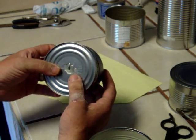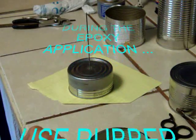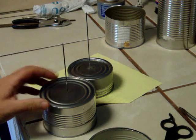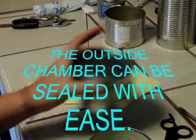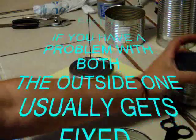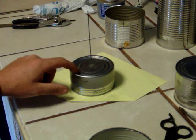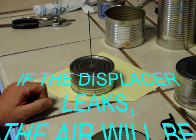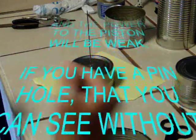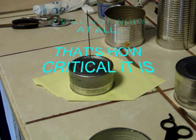The next thing we really need to do is make sure it doesn't leak — we don't want air to leave or come in. 90% of all home-built Stirling engines that do not work is due to a leaky displacer and leaks in the outer chamber, or too wide of a hole that makes it leak even more. The outer chamber leaking is about 15 to 20% of the problem, but this — the displacer — is 90% of it. If this leaks, all that air inside acts like a sponge. If you're trying to hit something with a hammer and there's foam rubber in the way, nothing's going to happen — it will absorb and cushion. Air compresses; you can put a vacuum on it and it's springy, just like your bicycle pump when you push it down and it pushes your handle back up. That's because of air pressure — air is springy.